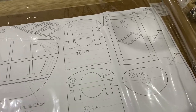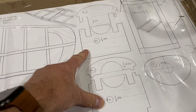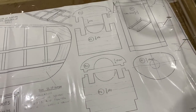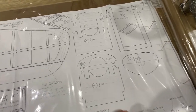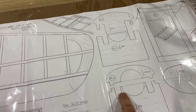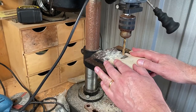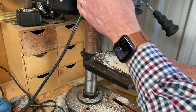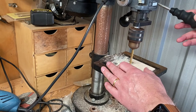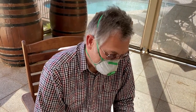Now the next part is to make these formers — they're designed to hold the fuel tank and they have to have a slot cut out of them to take the shape of the particular fuel tank you've got. This is the fuel tank I've got and it's a rectangular shape, not round, so I'm going to have to cut out a rectangular shape in here to take that tank. I'm going to use the drill press and then finish it off with the Dremel tool.